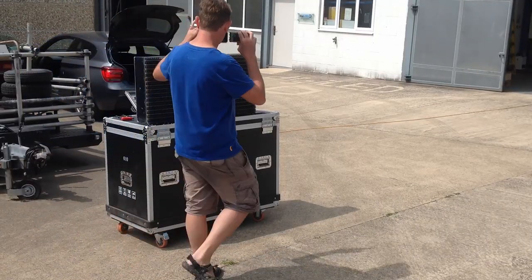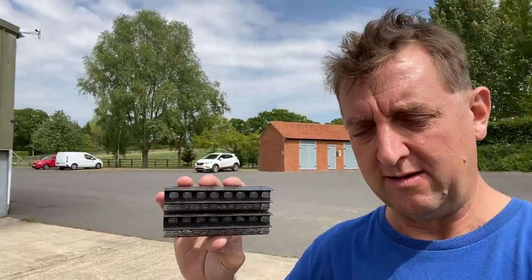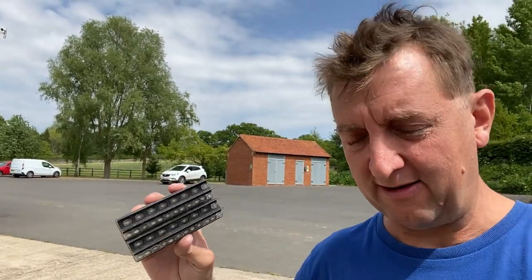So two greens were used in the pixels of this, specifically to try and get the brightness needed for outdoor use. Now at the time, Jumbotron with its CRT technology was just about hitting 4,000 nits of brightness. And I think the Sony boys knew that this was a bit of a problem for outdoor display screens. Hence, they relied heavily on shaders to try and give them the contrast ratio. Brand new Invision DCM15 would easily hit 5,000 nits. At the time, it really was the only technology that could produce a daylight visible video image.